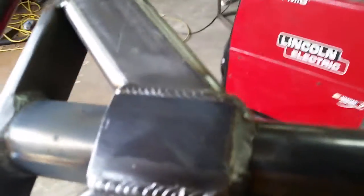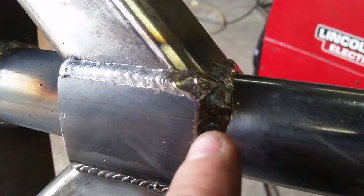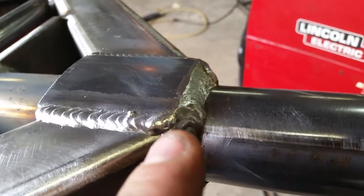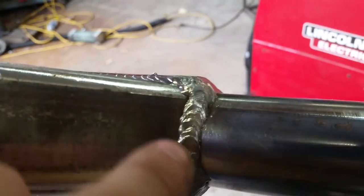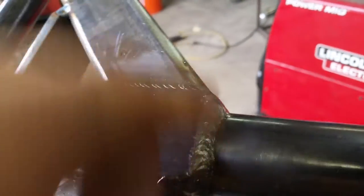One of the hardest welds to make — for me anyway. Right here you got two tie ends, and it's hot by the way. You've got this circle weld, you gotta speed up in here as you make the corner. Then you start getting to a spot where it's thinner — this is where the two actually overlap, that's the lap joint. Stupidly hard to get those to look good. Then you gotta speed up around the corner and slow back down because you hit the thicker metal in the tie-in.